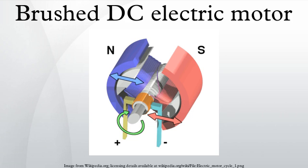The following graphics illustrate a simple, two-pole, brushed DC motor. When a current passes through the coil wound around a soft iron core, the side of the positive pole is acted upon by an upwards force, while the other side is acted upon by a downward force. According to Fleming's left-hand rule, the forces cause a turning effect on the coil, making it rotate. To make the motor rotate in a constant direction, direct current commutators make the current reverse in direction every half a cycle, thus causing the motor to continue to rotate in the same direction.